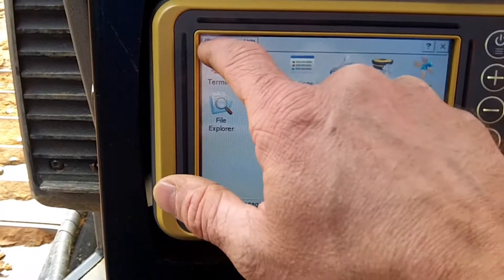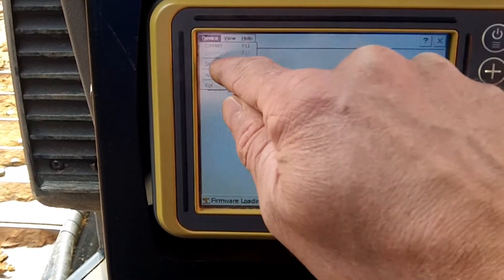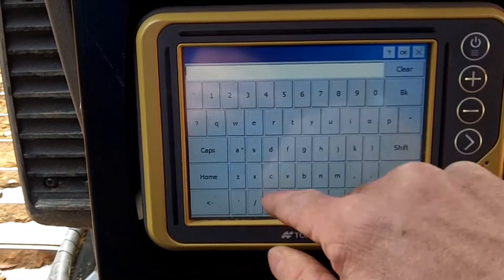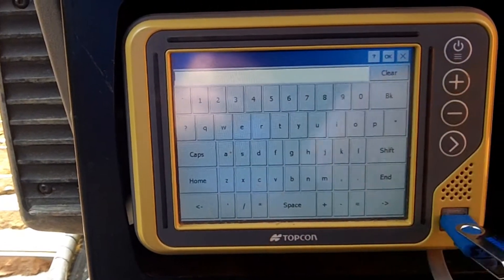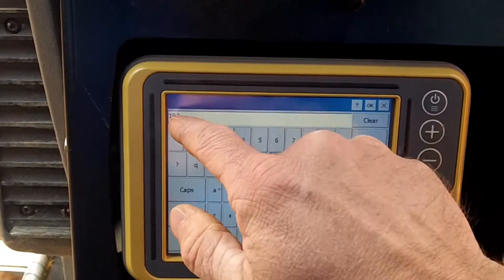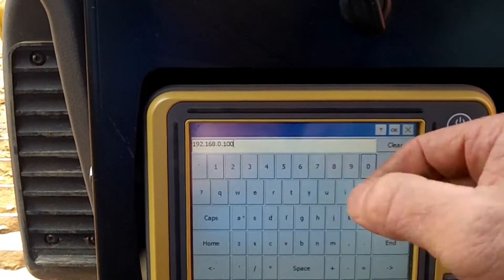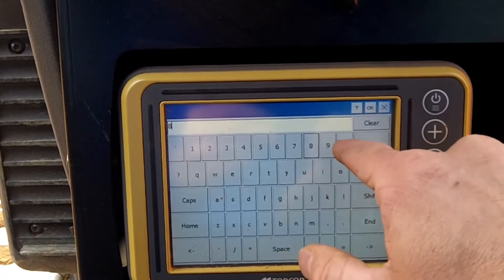Going to true device — device firmware loading — connect. This is MCR3 so it's going to be network, and they don't have their main in here so we'll have to add that main. Have to add an IP address. Main is 192.168.0.1, auxiliary is 101. This is an MC Square system, no auxiliary. TCP port 8002.